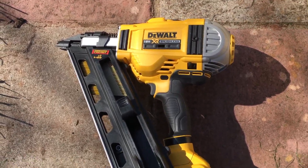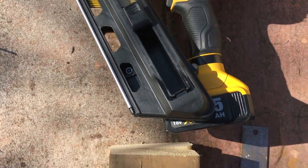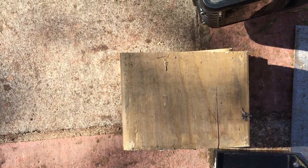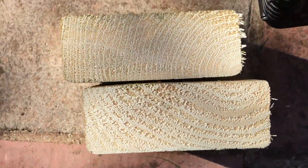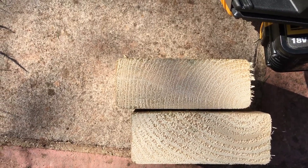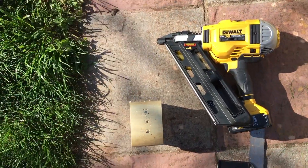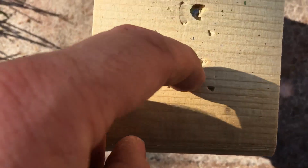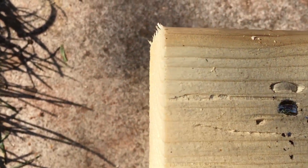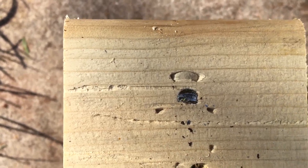Because I'm doing this on my own, I bought myself a brand new DeWalt nail gun — beautiful machine, excellent to play with. I've got some really big nails in there. What I'm going to do first is make sure the settings are okay and practice on a couple of pieces of wood, just make sure it's all set right, because I don't want nails hanging out and I don't want them fired all the way through. After three attempts I got it. I'd like it nice and flush. Now I'm going to make sure the frame's square, fire a couple of nails in each corner, and stick a couple of screws in as well for good measure.